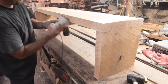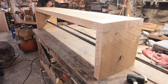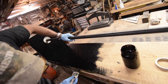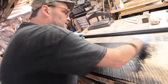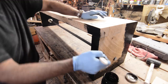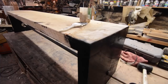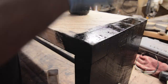I'm using 80 grit just to break down some of the high spots. Now I'm using a dye called WD Lockwood — it comes in powder form and you dissolve it in hot water. It's super concentrated and I'm making sure it soaks in really well. It's really the only way to get super black oak. Now I'm rubbing some sawdust into the cracks just to fill them in.